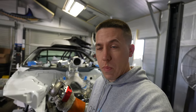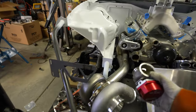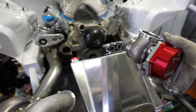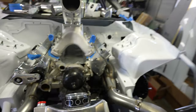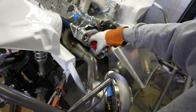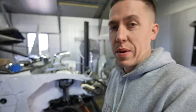There's only so many places I can put this thing to prioritize it. Make sure whenever you're doing wastegates, you make sure you can prioritize it as much as possible. Ideally, I would be directly in that bend, but even up a little bit, it's not such a big deal. A little less ideal on this side. Actually, just about perfect on this side, because the air is already starting to travel upward, so it's almost perfectly prioritized within that bend. Whenever you're doing wastegates, try to prioritize — do everything you can to not go stick this thing at like a 90 to the airflow so it just shears past it and doesn't even matter. It'll still do its job if your turbo system has a lot of back pressure, but I'd rather not have my system struggle with keeping the boost down, because those puppies are going to make some serious boost.